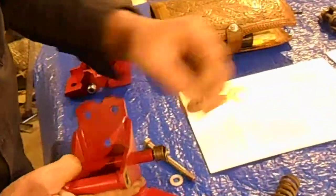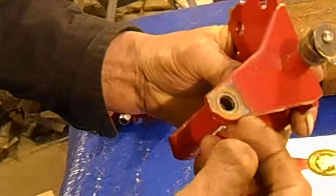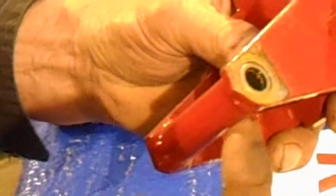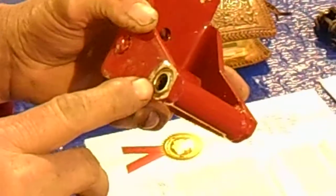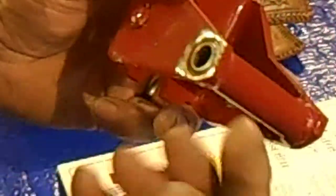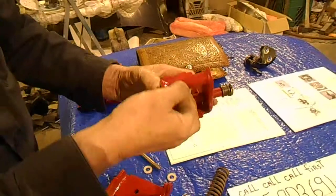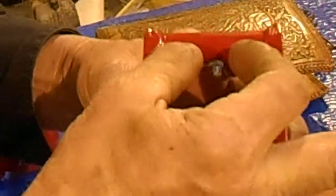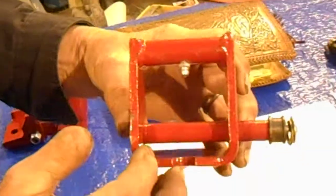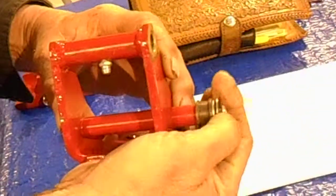Here are our neoprene washers that go in between to keep rust down. We also have needle bearings in this end, and on the outside of that needle bearing there is a seal to keep the grease inside of this channel. On the other side, we have a needle bearing inside that channel to keep the grease, and also a seal on the outside of the bearing that keeps the grease from coming out. We also have a grease fitting here that shoots the grease out into this channel and out into the bearings on both sides. This bearing will never wear out. This bearing will never drag. This bearing will never show any appearances of rust as far as metal to metal.